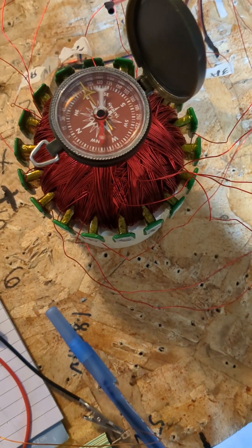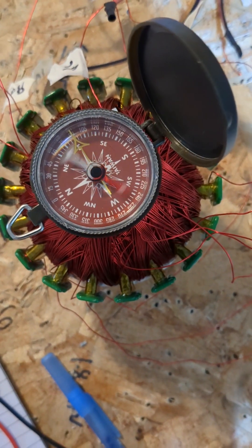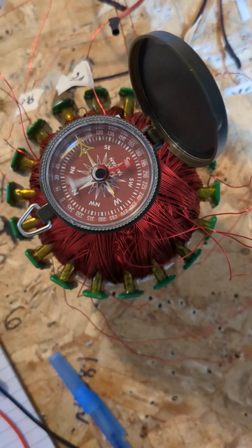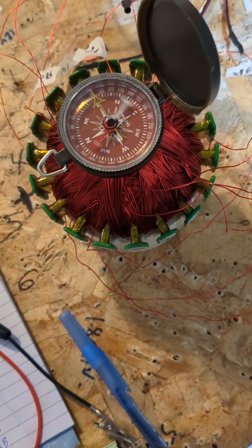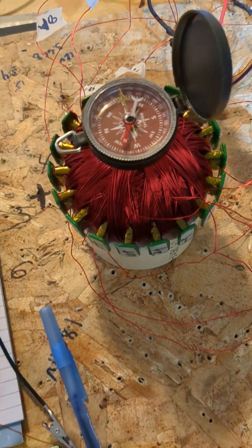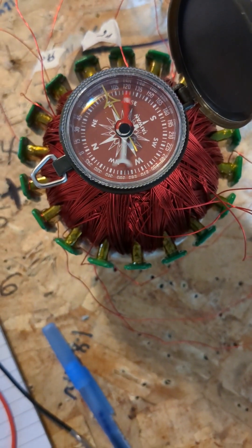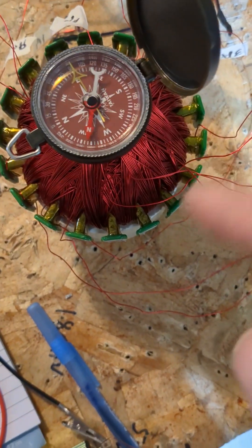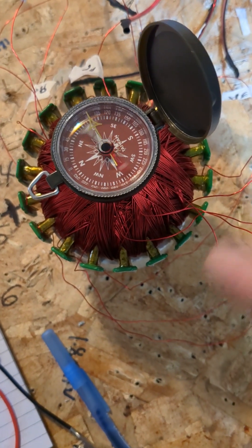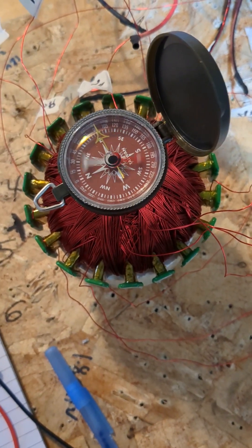It's always powering and going around in steps, and as you see it is rotating pretty nicely for half the rotation, and it stops, and then it does the other half. I'm gonna work on improving this. Next I want to show you what happens with the induction, so let me speed up the frequency, because that ain't gonna induct going that slow. I'm gonna speed it up, and this thing is gonna stop moving because it's gonna be going quicker than the compass could keep up with it, and we're gonna lose a bunch of the magnetic field because the higher frequency makes the amperage go down.